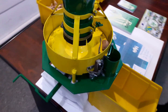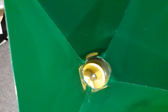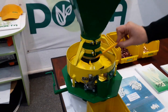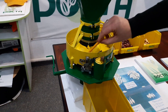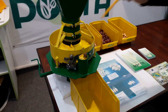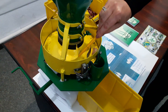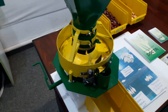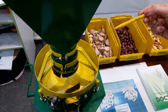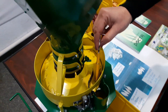The sowing unit operates in the following way. The sowing material is loaded into the hopper and the distributive cone is driven. The feeding cylinder is equipped with a flexible tube, its flexibility being reduced to the area of sowing material discharging, and it is installed eccentrically to a cone axis. During the distributive cone rotation, sowing material gets to its surface in the area located after the outlet opening, which increases the time and sowing material distribution on the cone, resulting in more uniform distribution while passing towards the area of interaction with the leveler and the push-off.